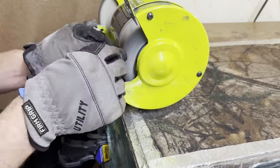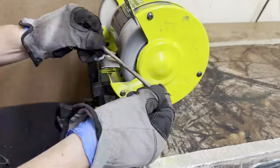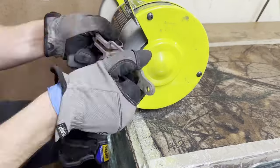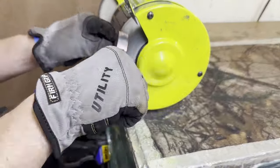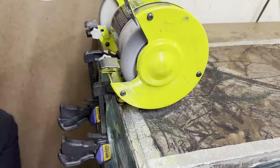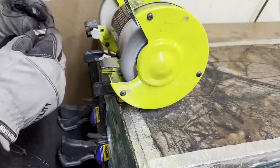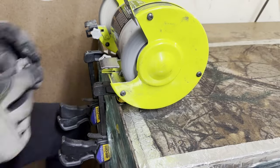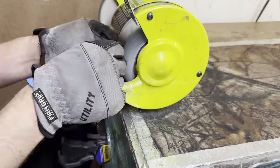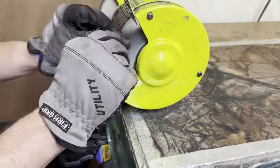I got the wire wheel at Home Depot for like $100 and it has been worth every bit. However, some of the smaller parts are kind of tricky to do, so I actually just used my drill with a wire wheel for those. The barrel probably takes the longest because you want to make sure that everything is nice and even — I start by doing a progressive rotary motion all the way down and then finish off by doing a more horizontal back-and-forth motion across. Overall, this thing has been such a time saver.